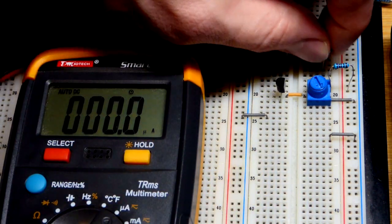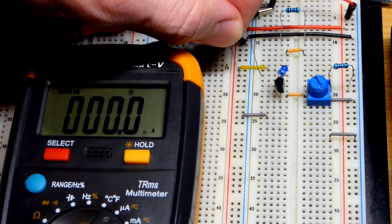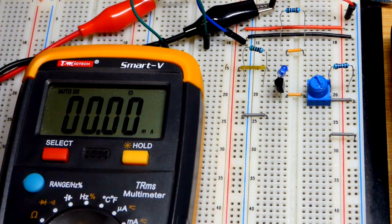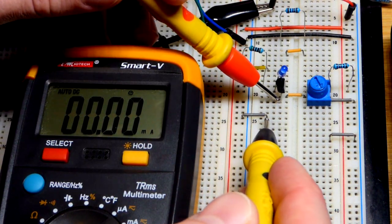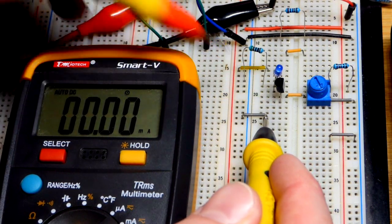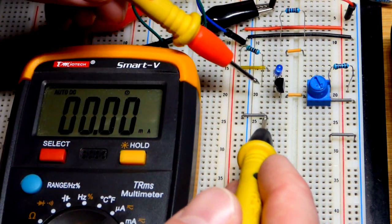And now we will grab the LED and put the short lead, the cathode, to the collector there. Long lead, the anode. We're going to connect a 510 ohm resistor again. And just to be safe, we will measure milliamps of current first, even though we know that we can expect only maybe about 75 times as much current. And oh, I put the resistor to the negative rail by accident. There we go, positive rail. Now we should get the current.